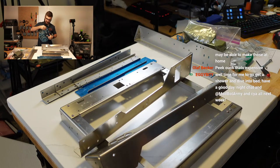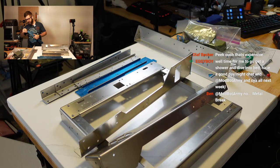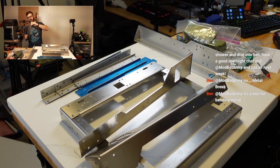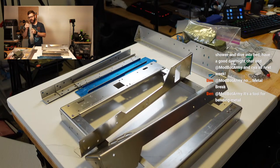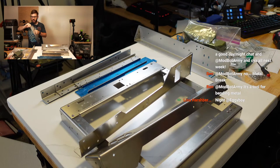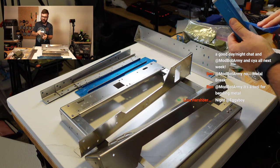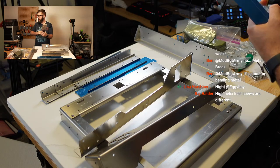My question with lead screws, and you said for XY, is how quick can they move? I mostly see lead screws used for motion on, what's the company Nero interviewed in Detroit? They're a Canadian company and they make the most monstrous CoreXY, and I think they use ball screws. But belts can move a gantry quite quickly. Most of the time I see lead screws or ball screws used in the CNC world. Are there motors that can move them quick enough to keep up with a belt driven system?